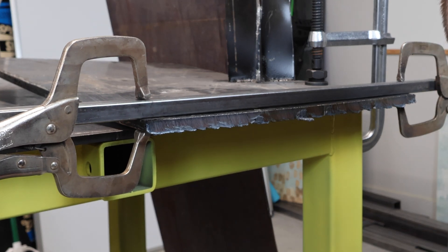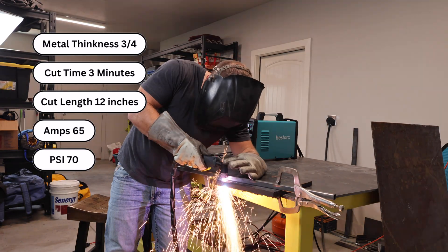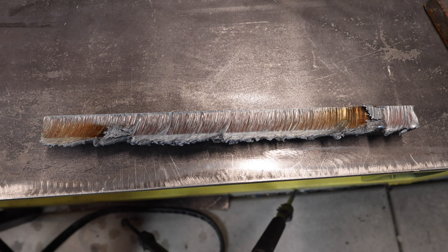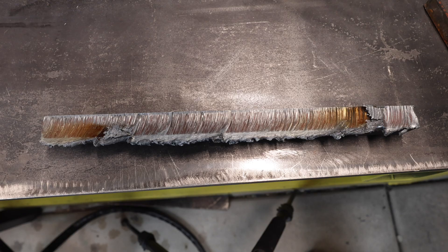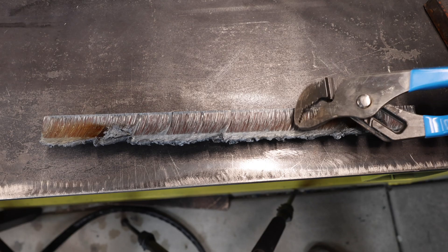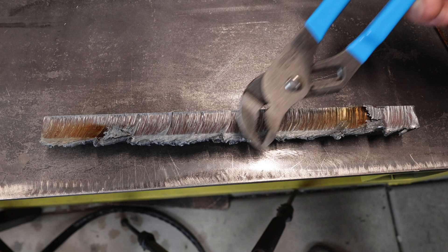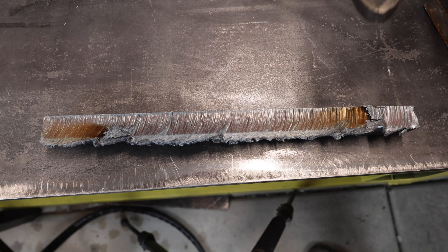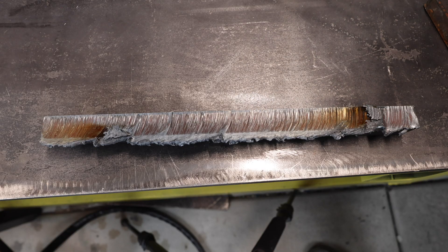But now it's time to increase that metal thickness and see what it can do. Three quarters inch — I'm actually really impressed here. This is a very thick cut. If you guys are cutting three quarters of an inch, you're probably doing some industrial type application — working on buckets or heavy plate work. This is about 12 inches long, and just by the swirl of the cut, I might have still been going a little too fast, or potentially needed a higher PSI. But overall, very good.